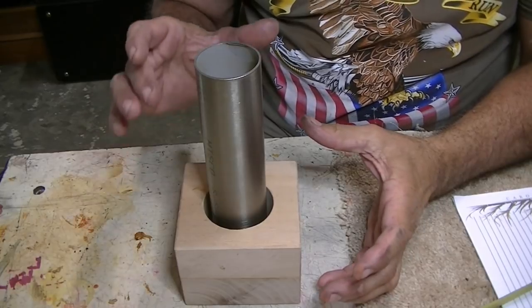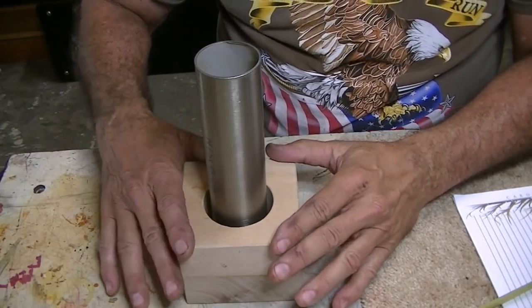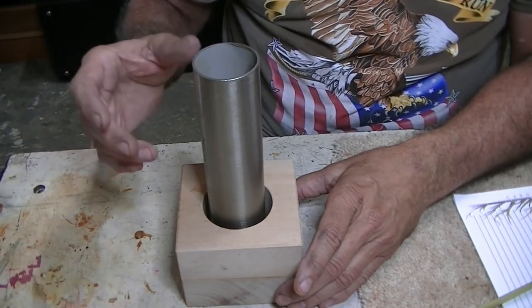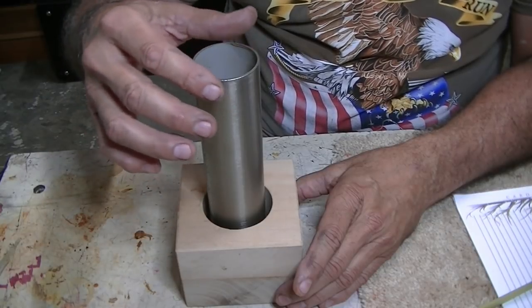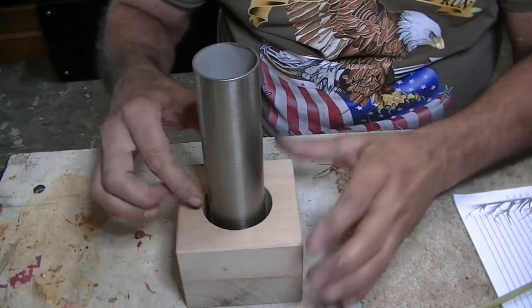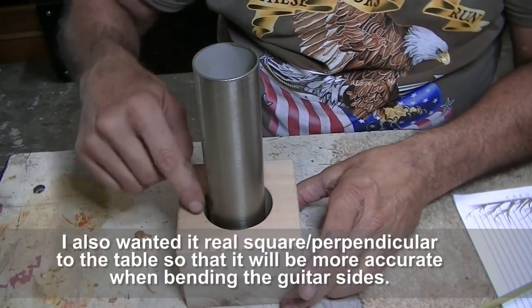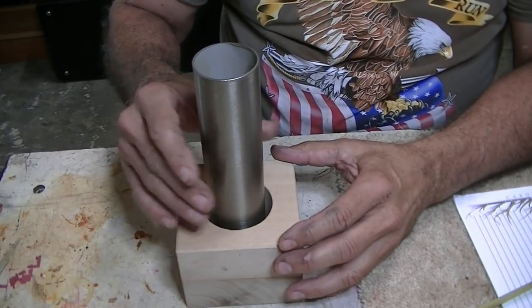You just saw me cut off and square the end of the stainless steel pipe. Here's why that's important: if I set this block down on a flat Formica surface and set this pipe down on it, I know everything is flat and level. Even though it was out three thousandths in eleven inches, now it's only eight and a half inches long, cutting that error down. Now I can set both on the table with an equal gap all the way around because everything's square and flat. I'm going to fill this gap with plaster of Paris to act as insulation from the wood.